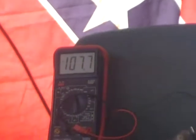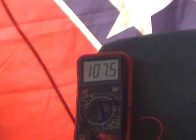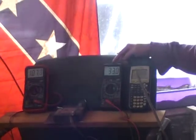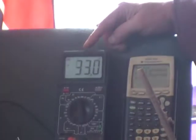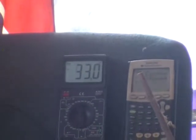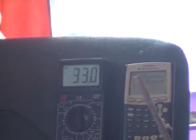As we see, this is now 33 milliamps, and that went down to 107 milliamps. We can make those fractions and compare to see if they are reciprocals or symmetrical. More importantly, this is now 100 to 33 — that's 3 to 1. When we started out it was almost 7 to 1. So there's a big discrepancy here, and there are even more intriguing things beyond that because we haven't compared the I²R losses to the actual energy transfer. I think we did a good job showing the differences and documenting the system components.